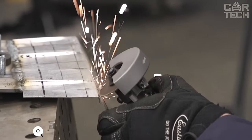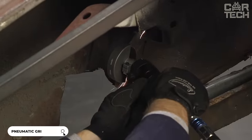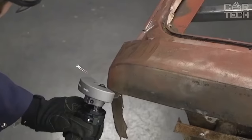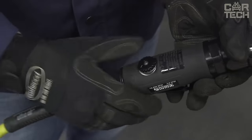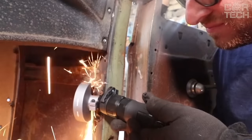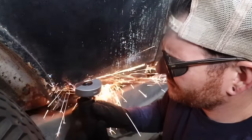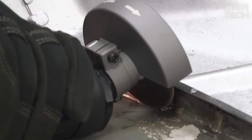Pneumatic cutting tool from Eastwood with a 3-inch wheel diameter. This is a professional heavy-duty pneumatic cutter designed for years of reliable performance. It is suitable for cutting sheet metal, pipes, profiles, and many other materials. The body of the tool is made of durable metal with a protective cover for the disc, ensuring high safety during operation. The integrated motorball bearing guarantees smooth running and long tool life. The rotational speed is infinitely adjustable by means of a trigger switch, allowing the cutting mode to be precisely selected.